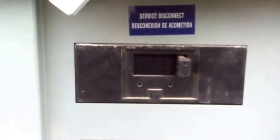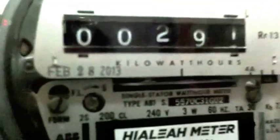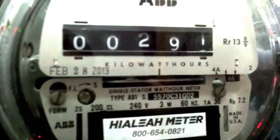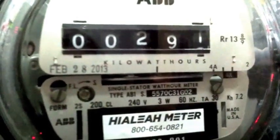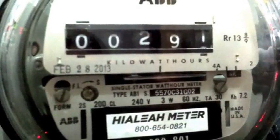All right folks, I'm ready to hit the main off, and we'll see what's powered up with the Outback. The UPS is on — that is the Outback system. Notice the meter is spinning. Let me wait for that black dash to come around. So it's definitely in battery backup mode. It's easier when you see that little black dash coming around — it's hard to see in the video, but it is moving. There it is — there's a black dash, and that shows how much power I'm using.